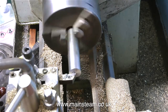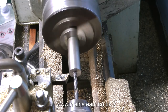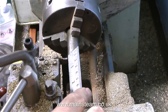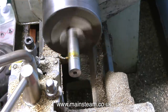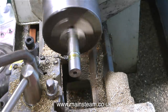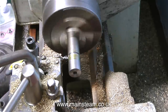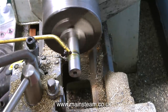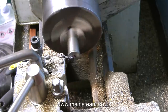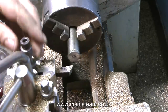The first part was in real time, and now this is speeded up — mass production. There are six of these to make. The process starts with a centre drill, followed by a quarter-inch diameter twist drill, drilling the hole in the piece of bar just over one inch. Then I apply some oil to the work and, using a parting tool, part it off. It's not a good idea to drill too far down a piece of bar like this because the drill will wander — only drill about an inch at a time. If the hole in the centre still looks okay and is still very central after parting off, you can use that as a guide for another one inch length of drilling. But if you need the component to be really accurate, re-centre drill every time. These are not required to be high precision parts.